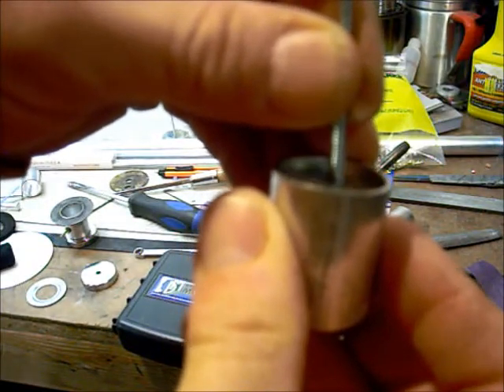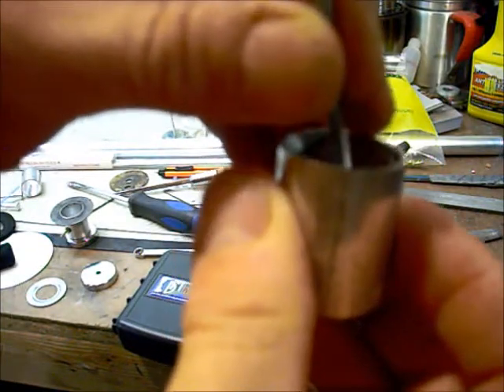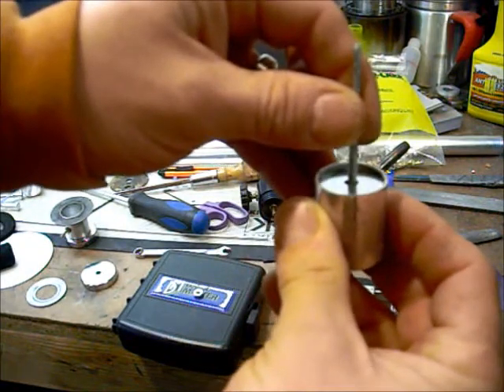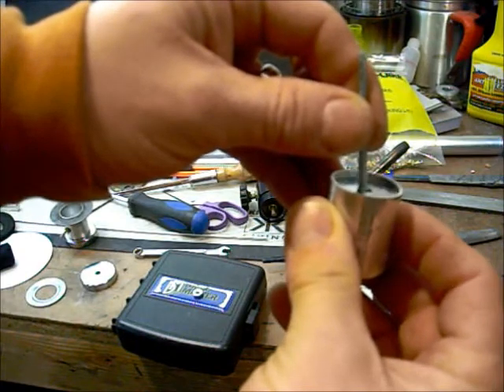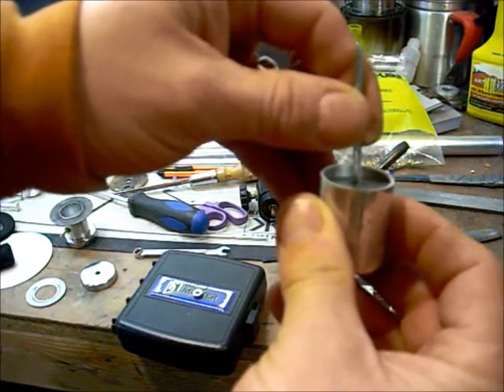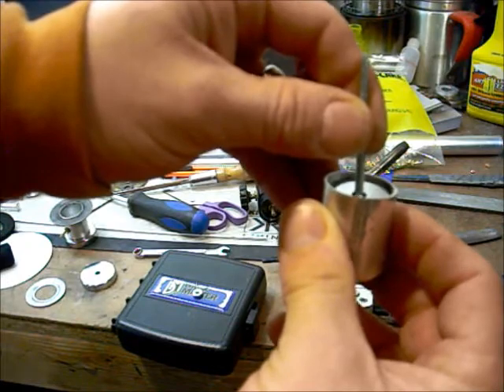Because you got that other washer that was in there holding it up a little bit, you got a little space in there. And that little bit of space is enough for you to sand off any aluminum weld that leaked through, because you don't have a perfect fit here — it's not perfectly tight. So some aluminum weld will leak through there.